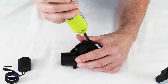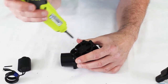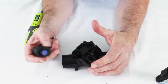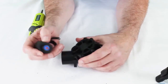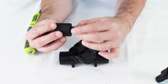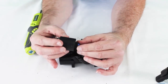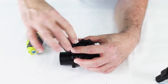Let's finish tightening this up and put our solenoid back on. If you're in the field in a dirty environment, use some clean water — a bottle or cup — and flush the solenoid threads out one more time to make sure there's no debris, grit, or sand down in there. On almost every solenoid of every make, the threads are pretty fine and you don't want anything stuck in there that would cause a leak or prevent proper operation.